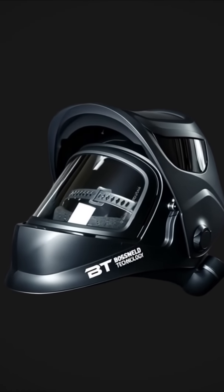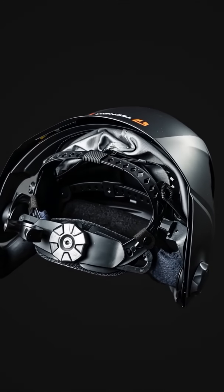Make sure the lens and face shield are clean so your vision is not impaired. If required, change out the outer lens and cover lens as required. To do this, simply remove the old lens as shown and replace.